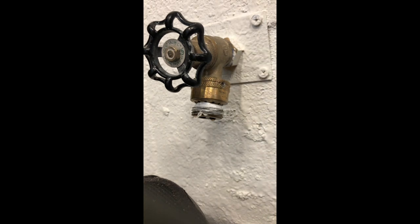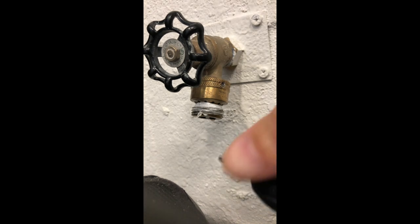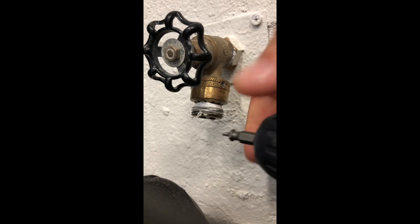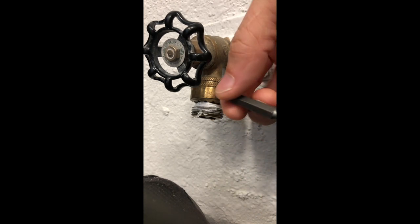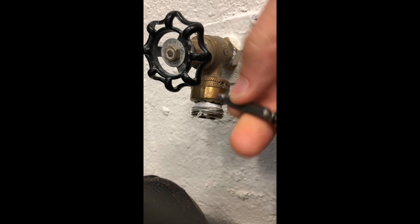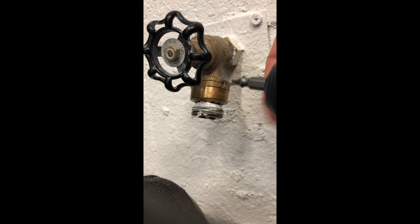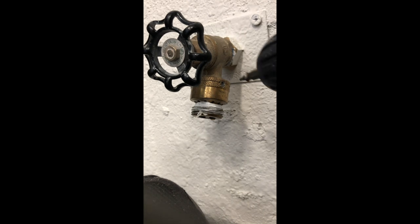The reversing bit will drill into the screw itself. Then you remove the bit, flip it over — as I'll show you here. The other side is the actual extractor. The first side is a reverse drill, which puts a counterclockwise drill in. This is the extractor. Turn it over. Again, insert it and push firmly so that it doesn't spin, and slowly apply pressure and the screw should back out.